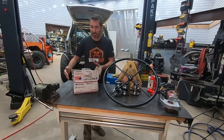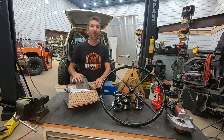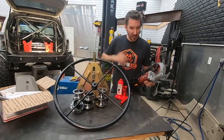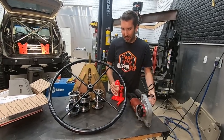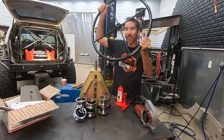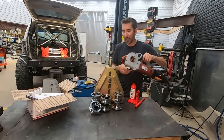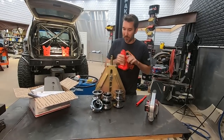All right, that is the swag kit. So here's what you guys are gonna do if you want an Uber Tuber roller. You're gonna buy the tube roller from Harbor Freight. With the swag kit, you're gonna need this. So this is an electric pipe threader. You're gonna need a bottle jack. We're gonna get rid of this. We won't need this anymore because after we're finished, it's gonna be an electric operated tube roller. The bottle jack is gonna go here, so we don't need to use this anymore.